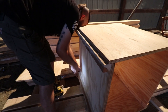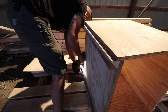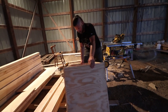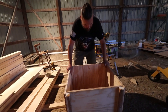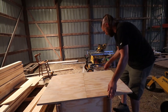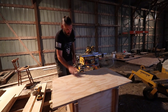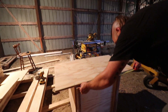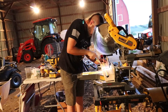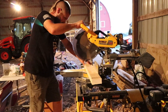The other thing you want to keep in mind is getting this flush is more important than getting everything else perfect. We're going to make sure the bottom is lined up on that line. The top is off — don't care about that as much. Now we just need the bottom. We've got two straight edges there, we can line those up. I just want to get a couple screws in there to hold these in place. What's really going to hold them in place is a couple more boards — 20 inch boards, just a 2x4. All this other lumber I have is rough cut stuff that I got from a friend with a lumber mill.